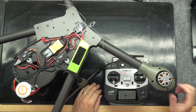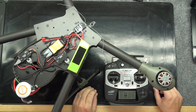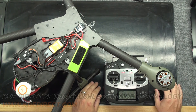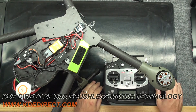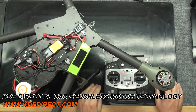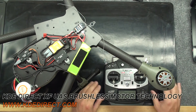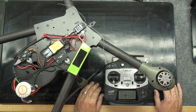And this is how you test an individual motor and individual power system with a flight controller that has already been built into a system. I hope this video helps you out by ruling out individual power systems. This is a very simple process — just having a spare battery connected to the receiver and isolating each individual power system will help you rule out and troubleshoot problems that you're having with a flight controller or a general platform.